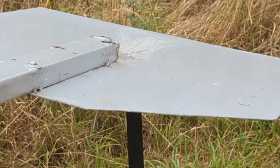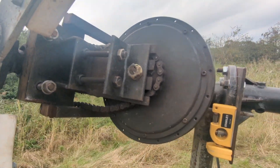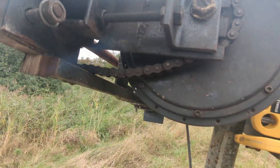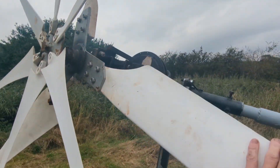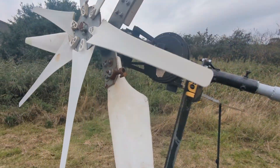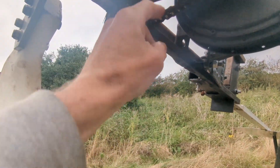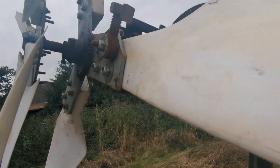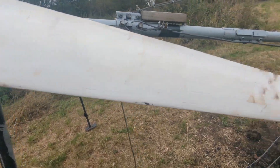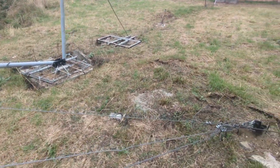The tail is cut out of a sheet of some kind of weird galvanized stuff. I just wanted to show you what it looks like down. That's how loose the chain runs — and it runs perfectly. When the blades go round it'll tighten up on the drive side, at the bottom — that tightens up and then the other side loosens. I had to bolt this weight on to balance the hub.